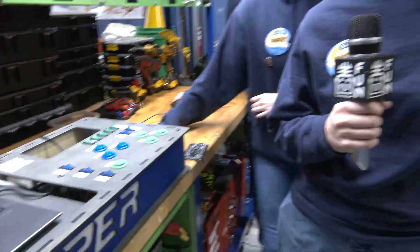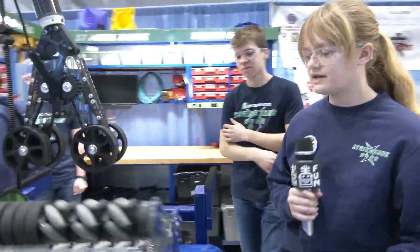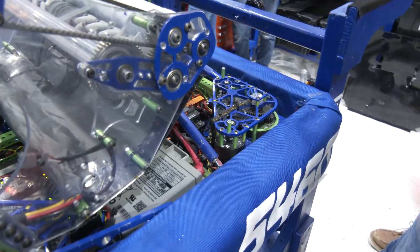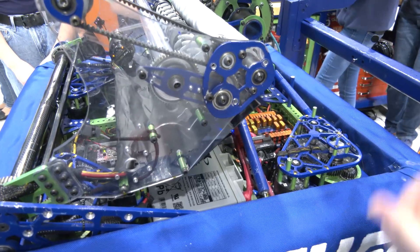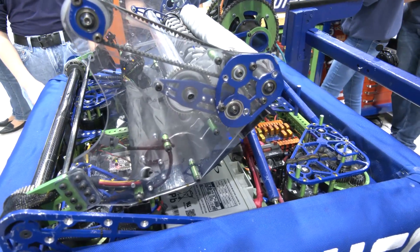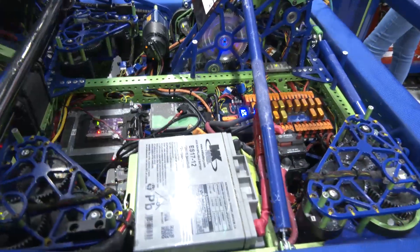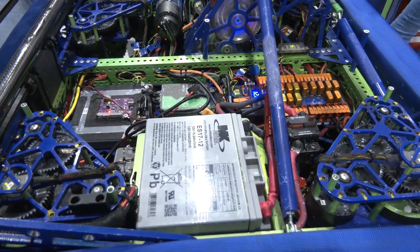I love the philosophy behind that, and cool to hear about the custom work as well. Congratulations on that awesome project. With our electrical panel on the robot, we designed it thinking about weight distribution, since we knew the arm was going to be on the other side. We ended up putting our battery on this side of the robot lying down to save space but also counteract the arm's weight. We also have our PCB and RoboRIO on that side to keep the shortest wire runs possible and save space for everything.